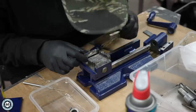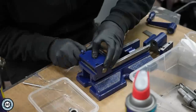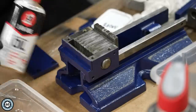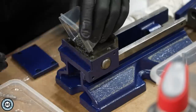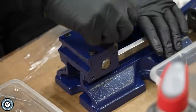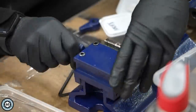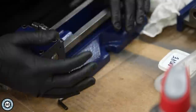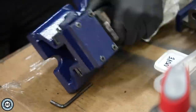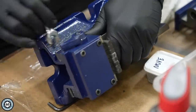It's a little tedious to get everything placed properly, but once I do it's pretty simple to get the rest of the rear jaw assembled. I put that little block back in and then I can go ahead and put some three-in-one oil in there before I fill it with the ball bearings. I had these separated so I know this is the exact amount I had taken out — maybe minus one or two that got lost along the way. Then I can tighten up the jaw with those Allen keys. You can sort of see the action of the little jaws and the teeth now, and I use that lever to reset them. I put the jaw in place and reinsert the pins. This has way guides on the bottom to keep the jaw from racking, so I tighten those up.